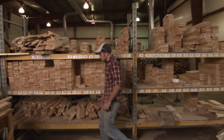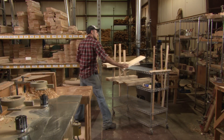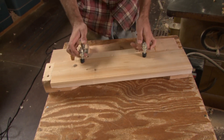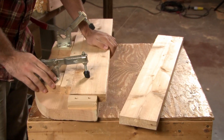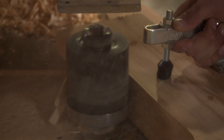Parts are stored according to size in a system called a supermarket, and then it's time for the builders to go shopping. He knows what pieces are required, draws them from his supermarket, puts them on his cart, and takes them to the shapers to create the actual shaped parts. They're shaped with a unique system using clamps and fixtures — the fixture has the shape of the part being made, and by clamping the board into the fixture and running it on the shaper, they copy that shape.